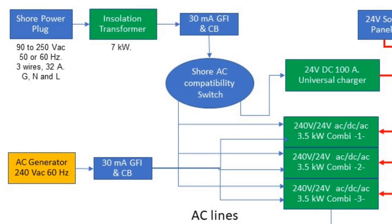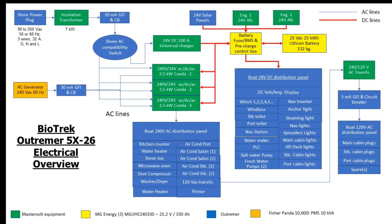So now you understand why, when preparing a boat for blue water cruising to different countries, it's super important to think about shore power. One of the biggest issues with electrical systems is their extreme variances all over the world. As far as voltage, as far as frequencies, as far as the way the docks are built, some places are very high level of skills, but some other areas the skill level is very low. Some of the docks are new with a new standard, some of the docks are old and with wires reversed. I've seen just about everything in our travel around the world.